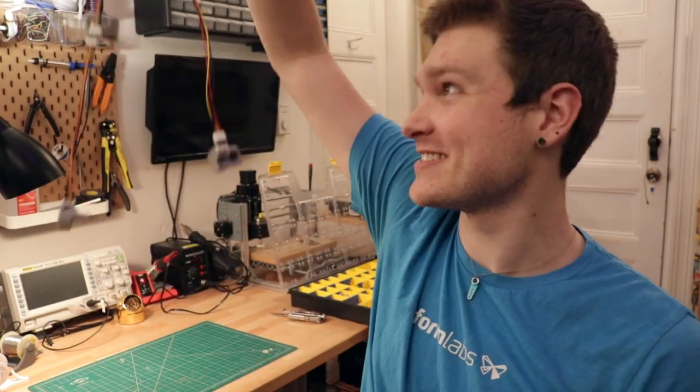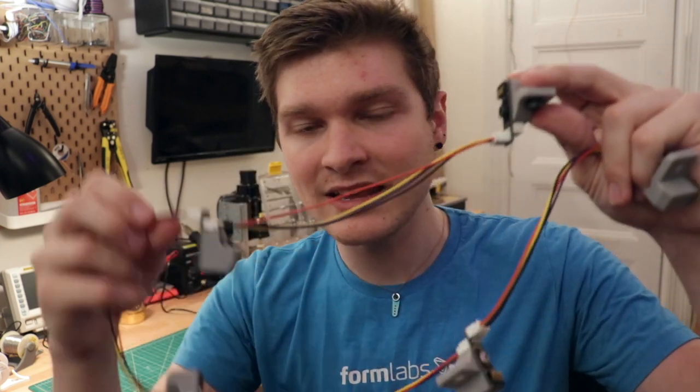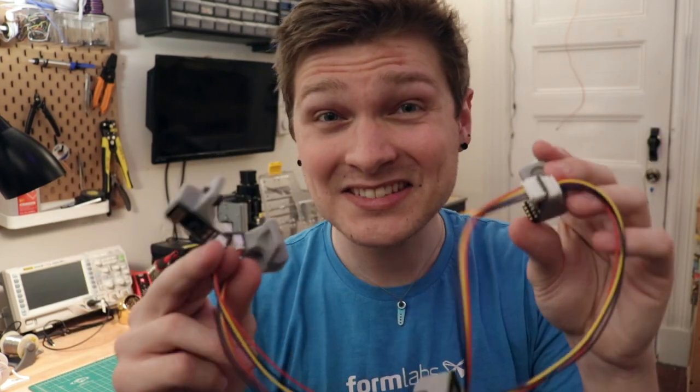A bunch of feeder floors. So all of these are almost done. They have the physical piece that mounts it to the front rail. They have the almost finished soldered feeder floor circuit boards and all the connectors and cable harnesses all wired up. I only have 5 of them here, but it's enough to get the gist. The last thing that I need to do to these is give them ID resistors.